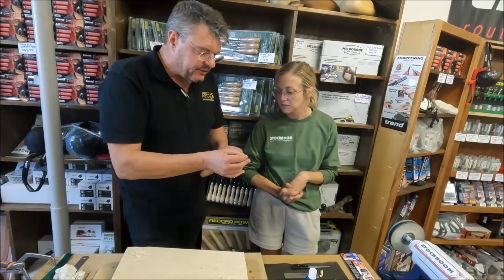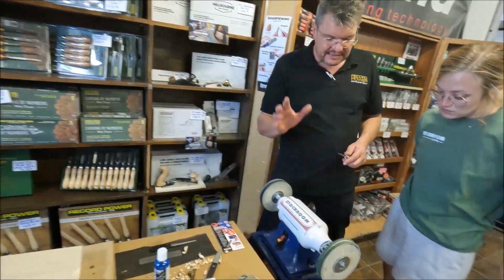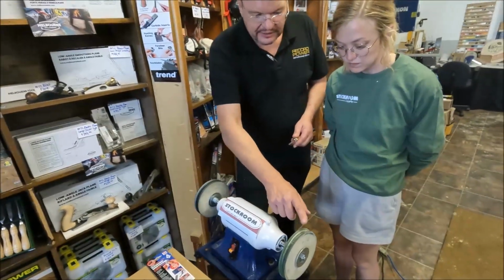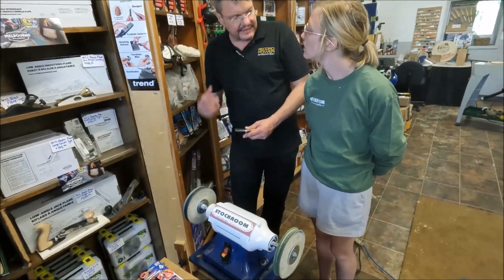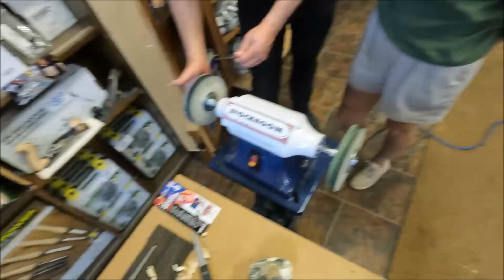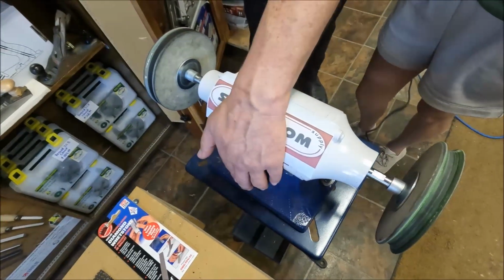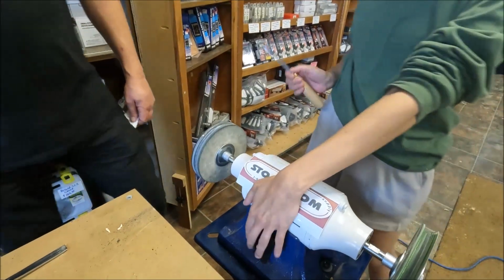Okay. So now, you have a go at that. Remember, it is a high-speed machine. If you touch these edges, it's going to hurt. So keep your fingers and loose clothing away, hair tied back, safety glasses on. Remember, again, it must travel away from the tool. And obviously, as we're turning it on, be mindful where your hands are. All right, so why don't we try that?